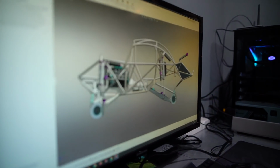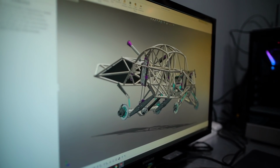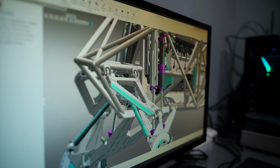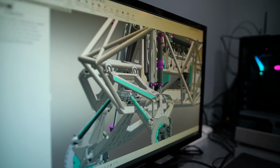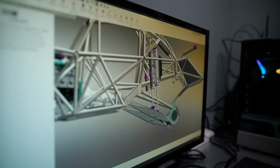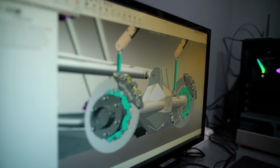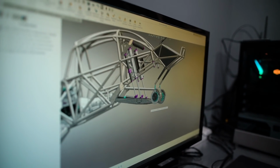So here we go. Here's the chassis, fully naked. All the suspension on it. What kind of wheel travel numbers are we pulling up front? In the front, we're looking at about 24 inches of wheel travel. Boom. Fully cycled. In the rear, we got about 32. 32. Cambered rear end housing. Cambered hubs. Wilwood brakes. All the good stuff.